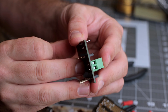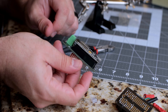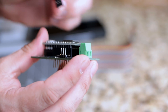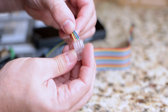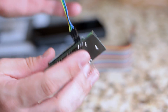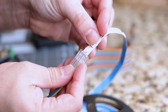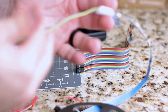Next we need to add our power terminal. This one can be tricky because of the short leads, but flipping the board over on the terminal block helps. Now let's insert our ESP and make sure it fits and can make contact with each of the terminals. Pay attention to the bottom of the board where it says USB and make sure the micro USB terminal is on the correct side. Now let's work on the LEDs. I'm taking a small section of female DuPont connectors and cutting them in half — make sure you know which color is which pin and don't reverse ground and positive. I really like these LED connectors designed to take lead wire and connect into an LED strip. Line up the DuPont connector with the lead wire side, matching the proper order of colors. In my case, yellow is the 5V pin, green is data, and blue is ground. Once inserted, press down to have the vampire connectors push through the wire coating, using pliers if needed until it locks. Then open the LED strip side with a small screwdriver, insert the LED strip end, remove some backing from the sticky side to help it fit, and press it closed.